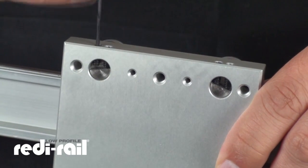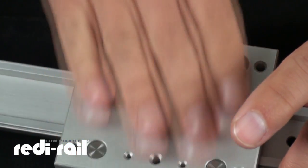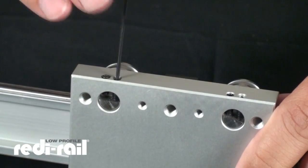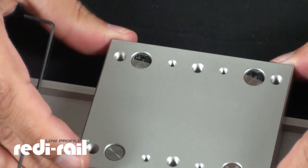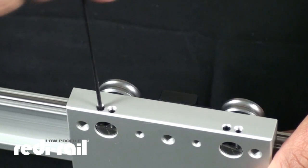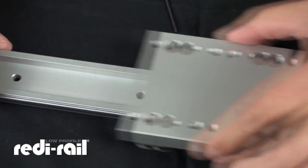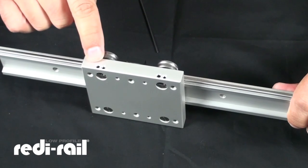I'll back this off a little more and tighten the other side up a little more. Remember, the advantage here is I didn't have to remove the plate or the gripper — I can make this adjustment from the side. I've adjusted it a little more and there's very little play now, almost to that sweet spot. A little bit tighter — I can feel it tightening up — and that's just about exactly right. Once I have it in location, I go back to the opposite set screw, tighten it down, and put the tension back in the system. These are now tightened in place with no play, giving a very low friction, high speed slider. I'll use thread locker again on these set screws so that they don't move.